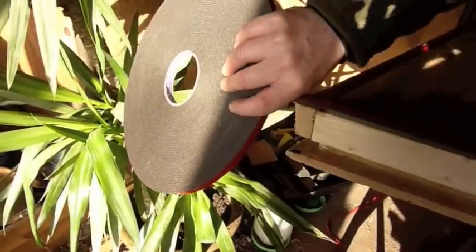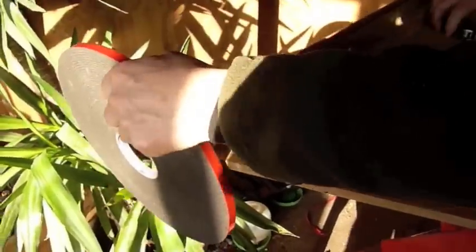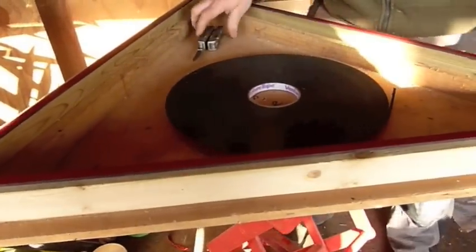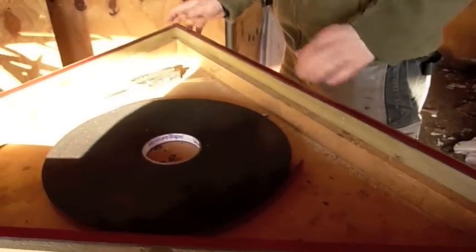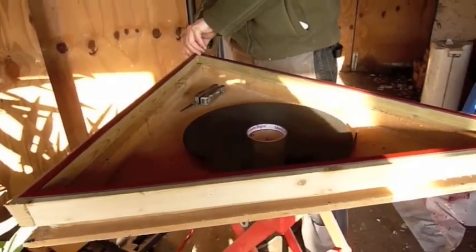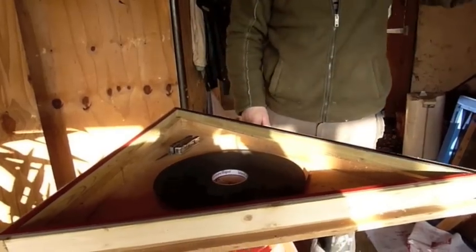There are 103 frames like this in a typical GD18 type dome, so there is a bit of work in it. You can paint the frame first, or as in this case, just put it straight onto the wood. The modern glazing tapes have a really good grip so that they will grip on painted wood or unpainted wood.